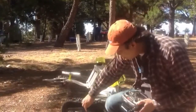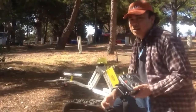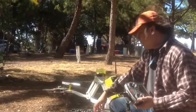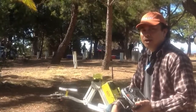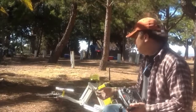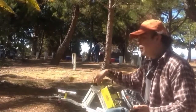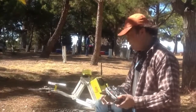So right now I can look on the computer and you can type the call sign on Google. And I can see it on the internet on a map, on the Google map. Where is the robot in the world? You can see the position and the reading, and the data that is transmitting, like radiation data. Basically, the data before decoding is a packet with the latitude, longitude, elevation and the measurement of the radiation.